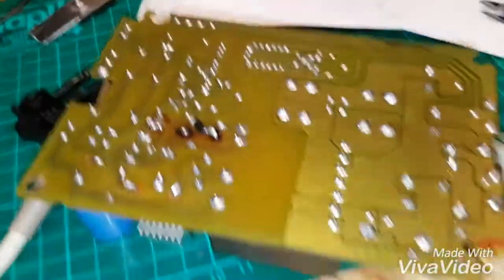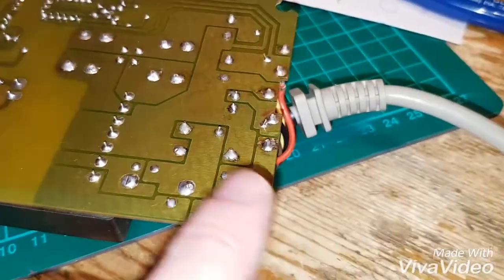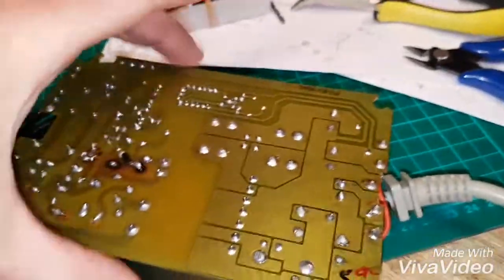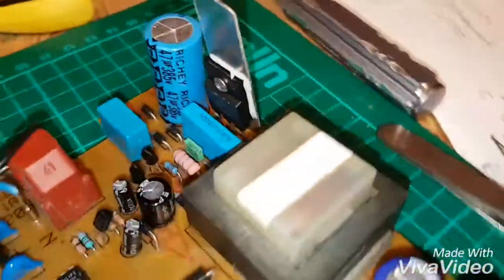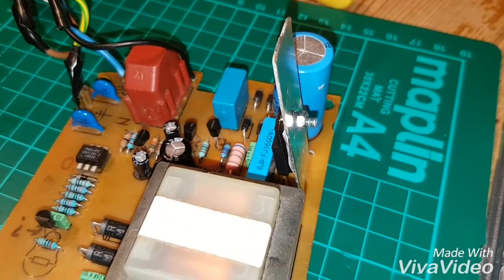Because when it was not fixed, there was 200 and odd volts sitting on that cap. Failing that, if you haven't got a resistor and you're brave, you get an insulated screwdriver and just bridge the two pads there. I have to say that because this can be dangerous. Here she is, all ready to go back — thermal compound, bolt, Loctite thread lock, and a really tightly done up rivet. Hopefully it'll stay there.